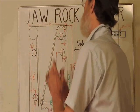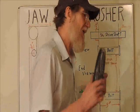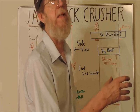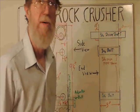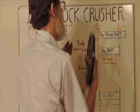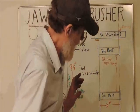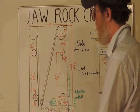Then the only other thing is, if you decide to increase the width and the overall size, you'll need to consider the pulley and the belt. You'll need a bigger motor, of course, too. You may exceed the amount of torque a belt can take. Now, I have an air compressor. It's a big 100-gallon tank Ingersoll Rand that can pretty much run a body shop. It uses a double pulley, and a double pulley on the motor, and uses two standard belts. I've never had any problem with breaking belts or anything. So you might want to double up, make your shaft longer and double up your pulleys, if you're going to make something bigger that requires a lot more torque. That would be pretty simple to do. I just wanted to mention that to you, that you can only handle so much with a pulley and a belt. I can't think of much else except for that. It's pretty much worked out as planned.